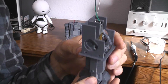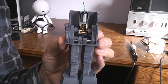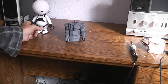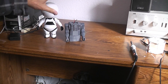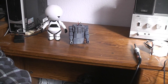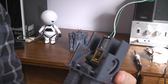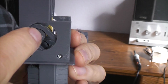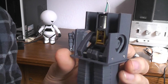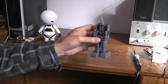Speaking of the mechanics down below, as you can see the little right-angle gear motor did arrive that I ordered from eBay — that was much cheaper, it was the way to go. Originally I ordered these when I was doing the other version of Marvin because I thought I'd do a build video for that, but there wasn't much interest and it's a lot of work doing a build video. It's been about two weeks for it to arrive. You can see the cams push in from the sides — that's why I put these holes in here — and everything lined up right so I didn't have to remake the leg linkages or any of that kind of stuff.